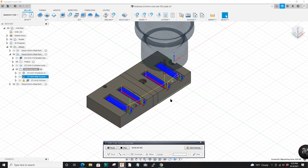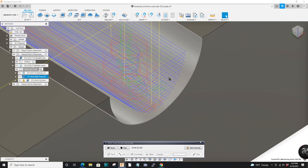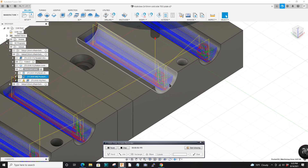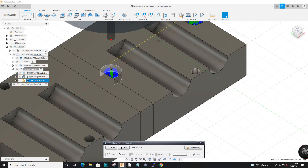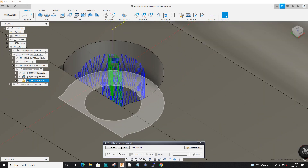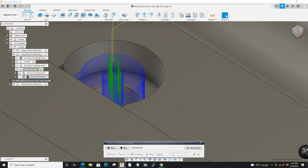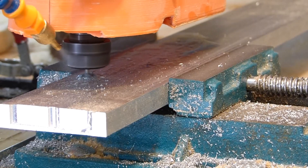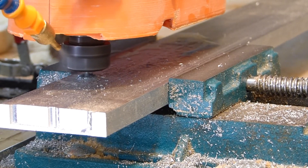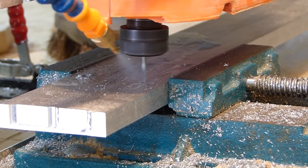There's also a pocket cutting that cuts these semi-circular pockets and it simply roughs them out. This is the toolpath in Fusion 360. I look at the toolpaths and make an assessment of whether or not I'm going to break a bit. Bits are expensive and it's a kind of a moral letdown when you break one.